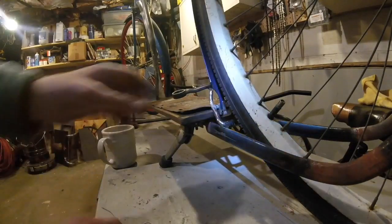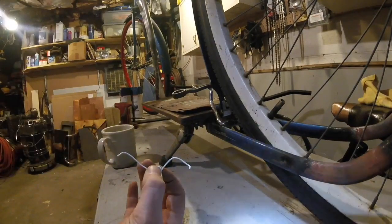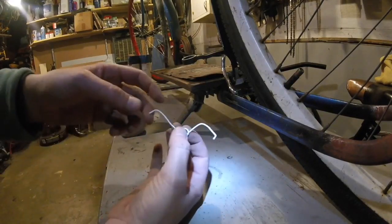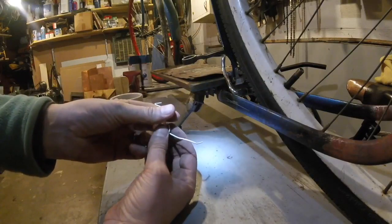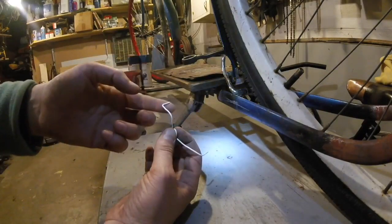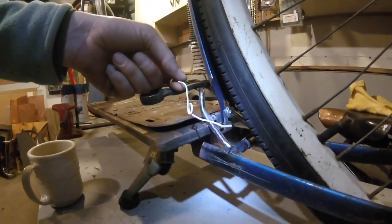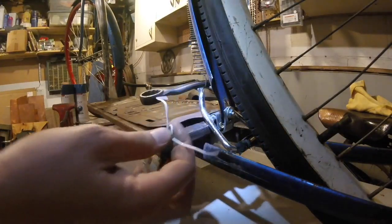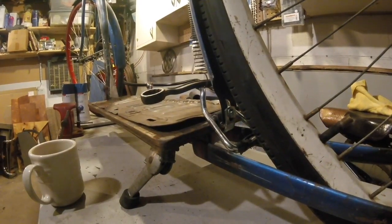How I figured it out, because I was trying to figure out how I could do this, is I took at work a little paperclip model. So I was thinking if I put pressure on my foot here, that puts pressure on the tire. I just needed the pivot point. So basically I needed to build this shape of an object. It can go this way too. Just so that when you put pressure on one, this end comes up, and then I would put a spring on it. And I got pretty much that exact thing going on here. Push on this, it lifts up this lever back here. So paperclip pipe cleaner models can sometimes save you some thinking time.